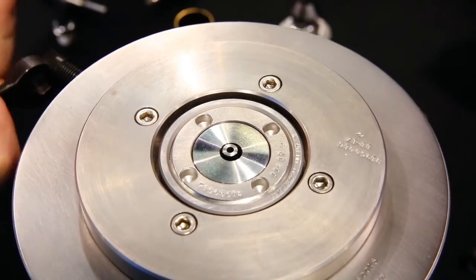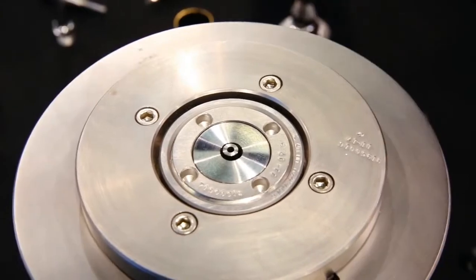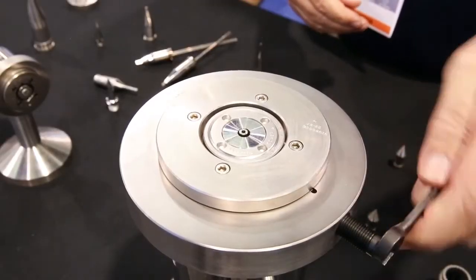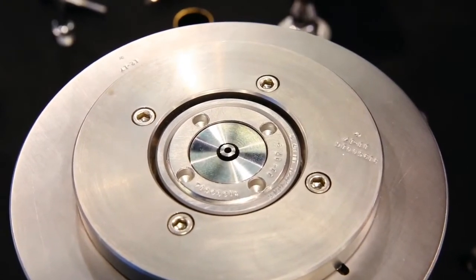To adjust, I'm going to quickly make a change — moving the single concentricity bolt 180 degrees and then in turn moving the die back into position so that you again have a concentric tube.